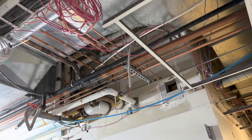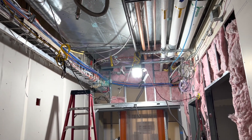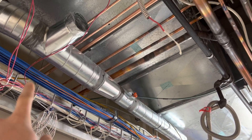It then hits the other strobe box over there, which is red inside the wall. I've got some more J-hooks going across which we'll use tomorrow for the last red circuit. We got three out of the four circuits pulled today.